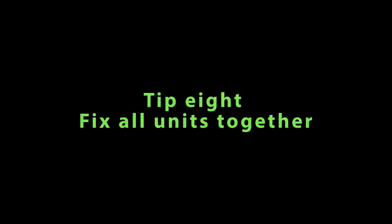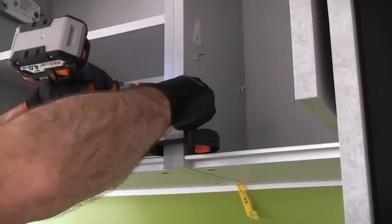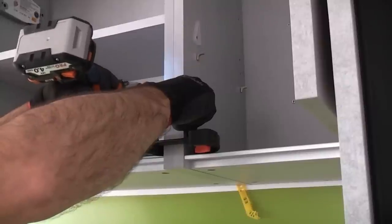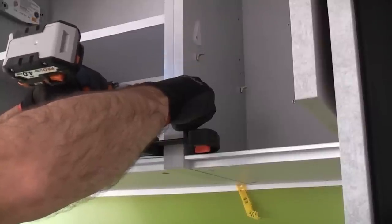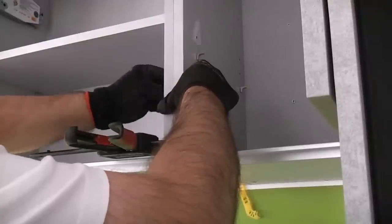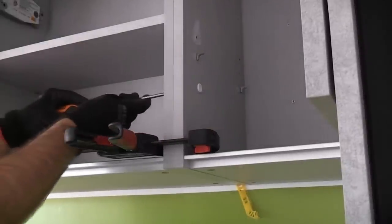Tip 8, fix all units together. It's a good idea to fit all units together. This can be difficult with some kitchens, including this one, due to the tall end panels. But all the other base and wall units can be joined together. This has many advantages, especially with wall units, as you can bridge over pipes and cables buried in walls. I have done a video on how to join the units together and we'll place that in the description.